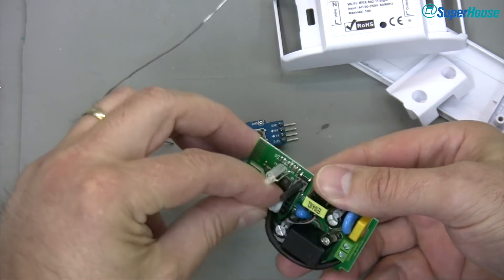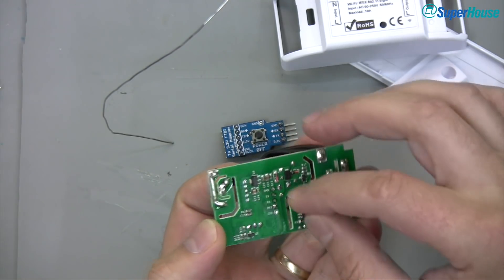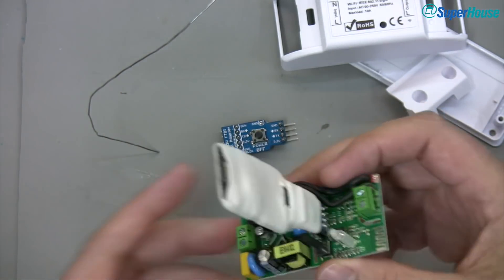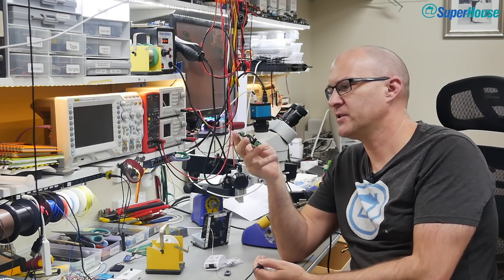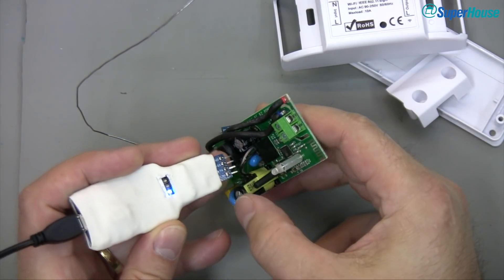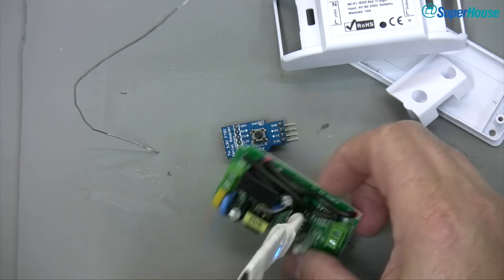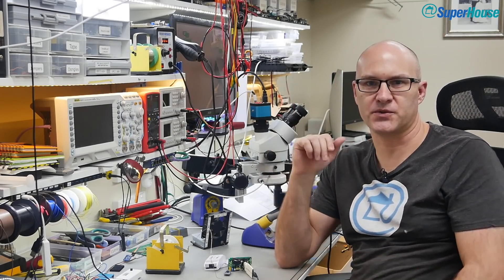That didn't take long at all. Now we're ready to go. On the Sonoff Basic, ground is at the top, and on my adapter, ground is at the top — it all matches. So if we plug it in there, that is the connection we need. But before plugging it in and powering it up, we need to make sure we put the Sonoff into programming mode. With the Sonoff Basic, that's super easy. All you do is hold down the button while you are connecting power. So I'll just press in this button, insert the programming adapter, let go, and the Sonoff is now powered up and in programming mode, ready to receive Tasmota. From now, we're just getting into software — hardware is all taken care of.